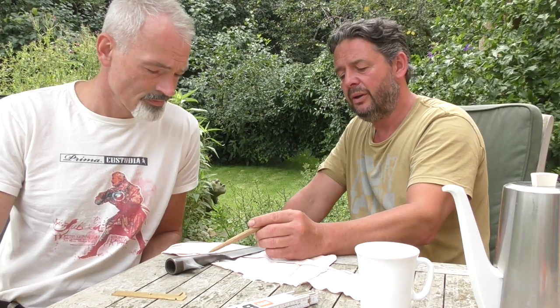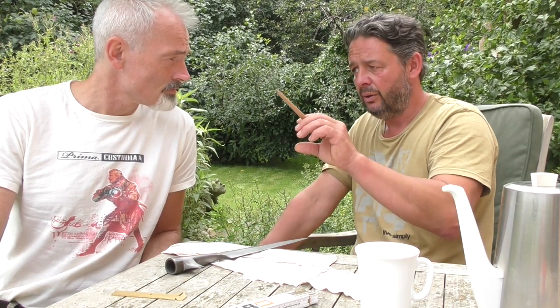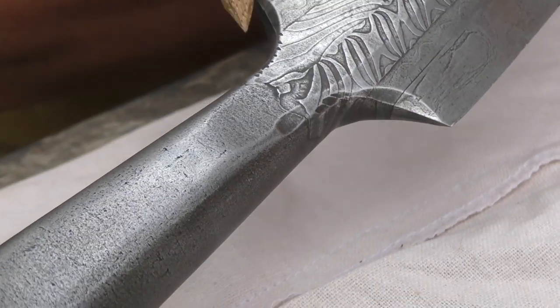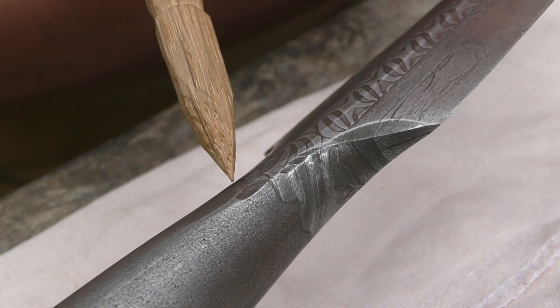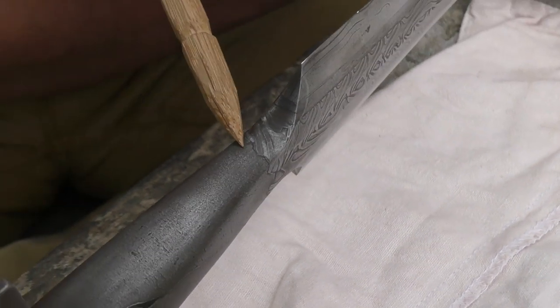Now you need to weld the blade to the socket. And this was something that we thought was really, really difficult. The slags can't go anywhere, and you could see it clearly in the original that the tube here, the socket, was forged. It was not used as a round piece. It was forged square. So originally the cross section of the socket is square, and likewise on the blade, which is also square and a little bit tapered, so it fits in there.